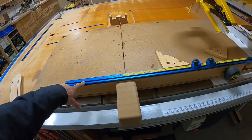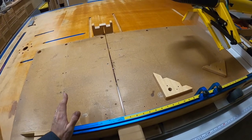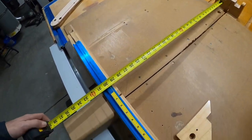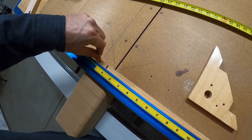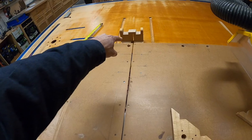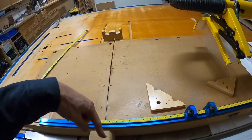The reason I'm not going to use Baltic birch is because it's heavy. The ultralight MDF — I have those sheets all the time and they are light. When you build something like this, it's a pretty big piece and it's actually fairly heavy. As it sits right now I can cut 29 inches. That's actually been reduced because I put some backers on. If I removed those two, I'd be at almost 29 and three-quarters or 29 and a half max cut.